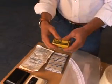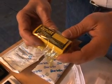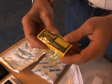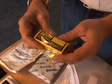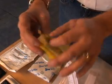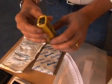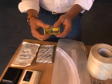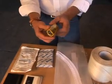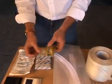Now this is an interesting product also. It's called a Z-Rust capsule. And Z-Rust capsules are designed to protect a certain cubic foot area, such as an engine compartment, electrical areas, or electrical boxes. So it's self-adhesive. You stick it inside, and this one will protect 2 cubic feet. So you stick it inside, and it'll protect electrical circuitry against corrosion. Also, ferrous and non-ferrous metals can also be protected where there will be no corrosion occurring.